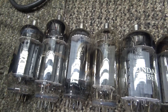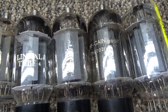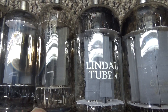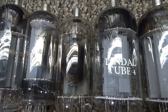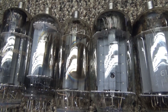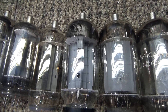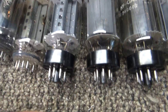If somebody wants to say the 6LF6 or 8950 are 40-watt tubes and that I'm wrong — well, here are the actual 40-watt rated tubes over here to the right. These on the left are the 30-watt. Here is the 30-watt 8950 tube — nice size plate, nice looking tube — and here is a 40-watt 6LW6. Tell me you can't see the difference. Not only is the glass bigger, but the plate is a lot bigger on the 40-watt tube.